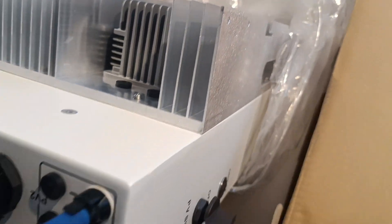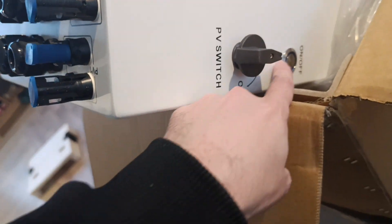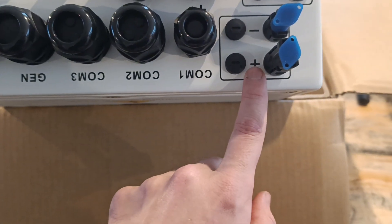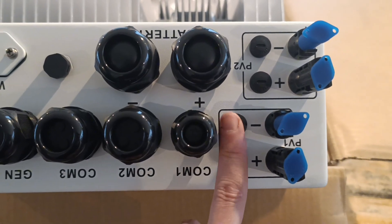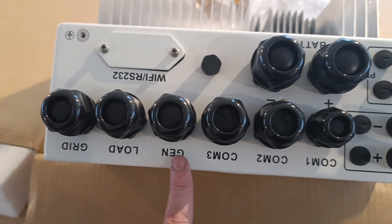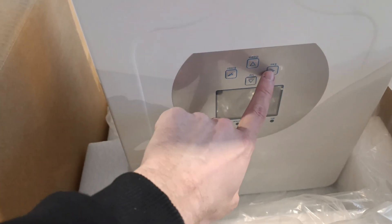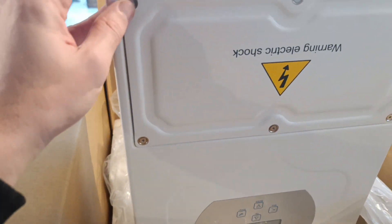The PV switch is on the side - on my five kilowatt it's down there, and the on button is also on the side in my case, which is not convenient. Now this one is technically made to have double PV1 input and double PV2 input, but currently only one exists. On the other side we have grid, load, gen, communication terminals, and battery terminals - everything sealed, nice and neat. The screen is exactly the same with physical buttons and touchscreen as they normally do with the older version inverters.